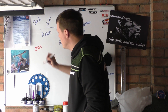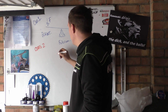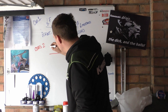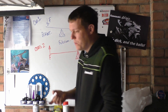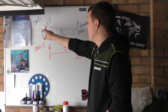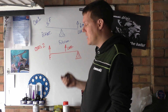We also have a class two lever. An example of a class one is like a seesaw. A class two is different — we have our beam with the fulcrum right at the end. We apply a lifting force here and our load is here. Our load moves in the same direction as the force. With a class one, when you push down here you lift your load up on the other side, but with a class two you lift and your load goes in the same direction.